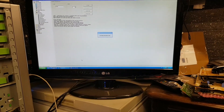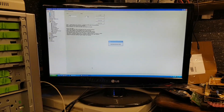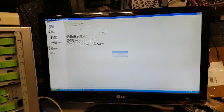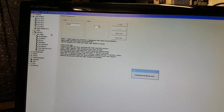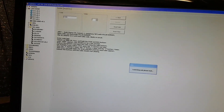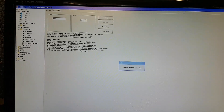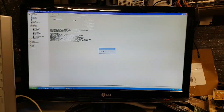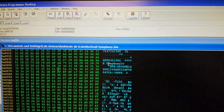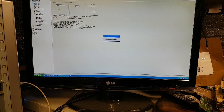I did a quick search trying to look for some sort of repetition pattern but I couldn't find anything — I only spent about five minutes to be honest. I don't know the position where the code will be. So I tried other software — Carprog does actually have a function for radio codes. There's one here for Blaupunkt, Volkswagen and Audi, Blaupunkt 2007 onwards. The car is 2007 but the radio is a 2005 Symphony 2 Plus. Nothing on the radio shows it supports MP3, but Carprog has a function to extract the PIN from the EEPROM.